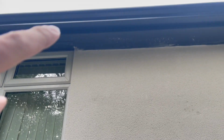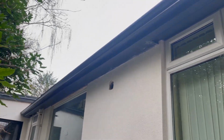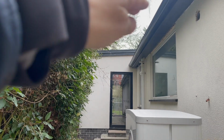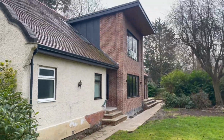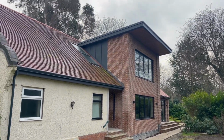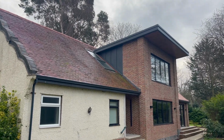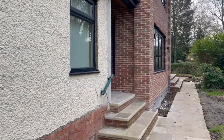DC cable run when we come back, I've suggested going straight up there. This is an aluminium soffit, so there's no loft space. So I'm probably going to flexi-copex it onto that soffit board and go straight along. She wants some panels on this 6-degree roof, and then there's another roof, 16-degree I think it is. There's a bit of difference on that house. So DC cable's going to be a bit awkward because there's no loft space anywhere. So we're going to have to work some magic and try and hide these cables when we come back. So that's that. The gateway, I'll show you what I'm thinking.